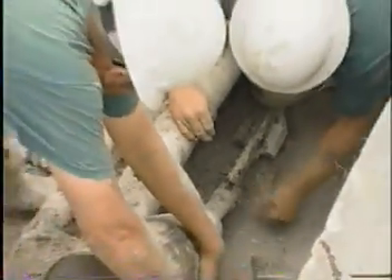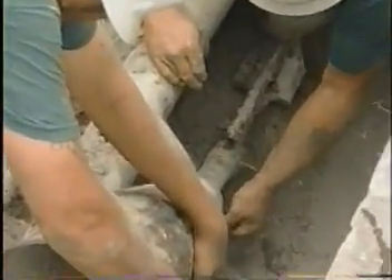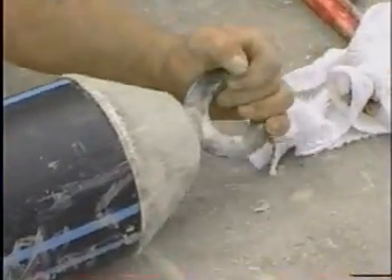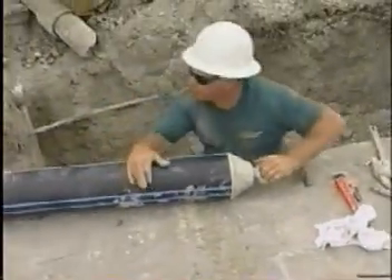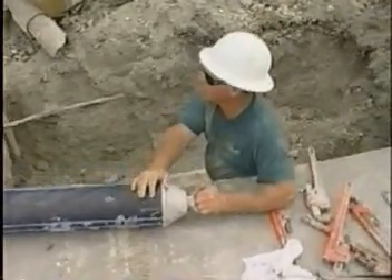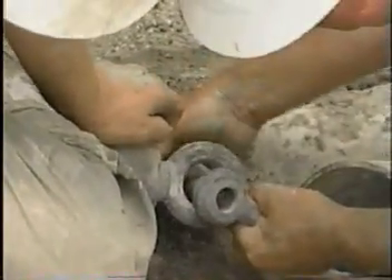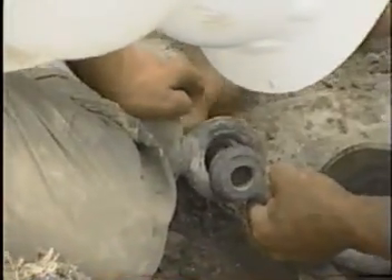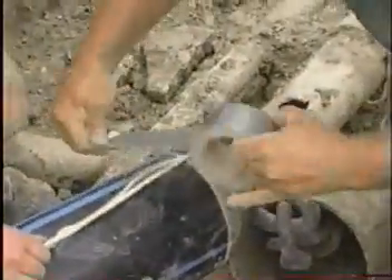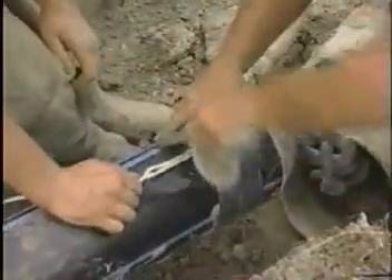What we're going to do now is attach the expander to the splitting head. On the back of the expander you'll see our rod with our shackles, which will then hook to the HDPE pipe, which is already pre-chlorinated. Once we have all this hooked up, we'll start bursting and pulling back. To attach the expander, we just hook it to the back of the splitting head and the pin goes through and anchors it in place — it's a simple, easy, quick method. At the end of the pipe we have the pulling eye, which is an expanding eye. It inserts inside the pipe and we turn it out on the fins, which locks the pulling eye into the pipe. That is what attaches to the back of the expander. Once in position the shackles screw into the pulling eye. Then we hook a tracer wire to the end of the pipe so once the HDPE is in we have a way of tracing the pipe.